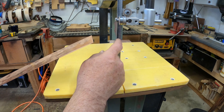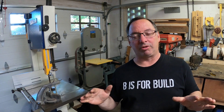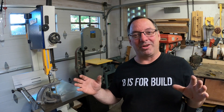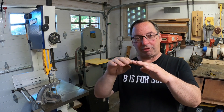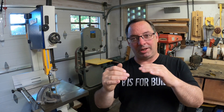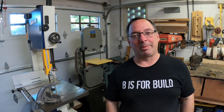I think before I cut out the top I'm going to get a different, narrower blade — which is a bummer for this video because I was hoping to have a top cut out by the end. How do you guys feel about that bandsaw mod? I like the slower speed — it was way too fast before. I have a feeling you're about to hit me with a bunch of comments about things I wish I'd known earlier. The bandsaw is better than shears because shears always tear up one side and roll the material. The cutoffs are important because I need them to make other little parts, so I don't want them trashed by the shears. I'm really hoping the bandsaw will help me cut this stuff cleanly.